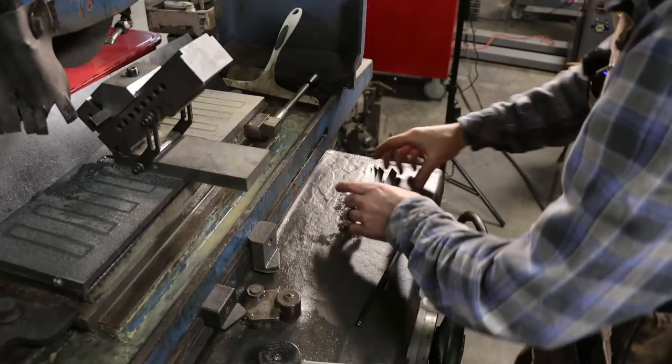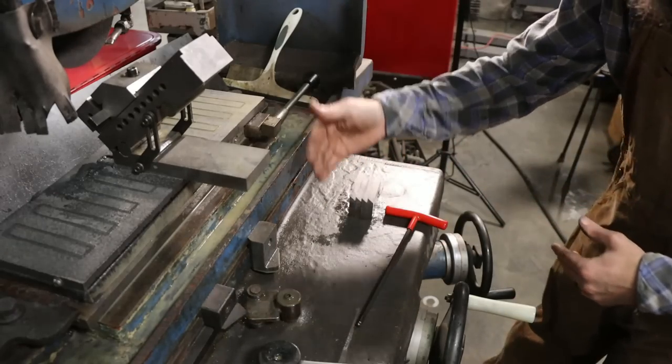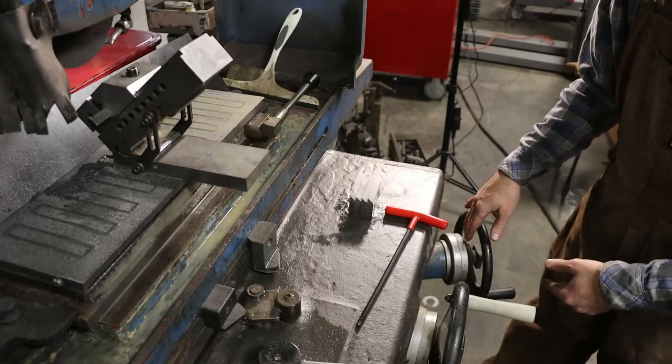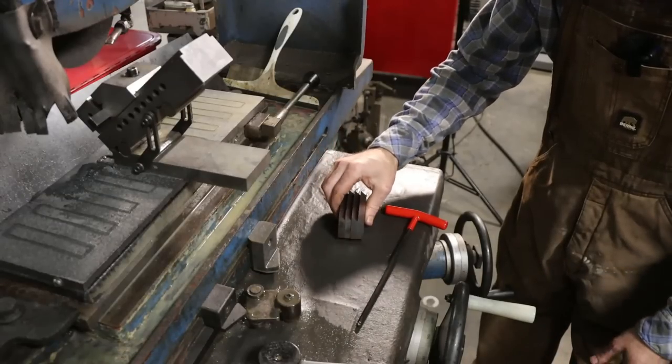All right, so all four of these fixed blades, they've been dressed down really nice. Now, I took what I thought was the worst one, ground it till it cleaned up. It ended up being about 60 thousandths. I set that as a zero, and I ground each one of these down to the same zero. So they technically are the same height.